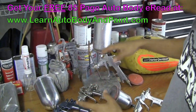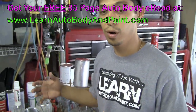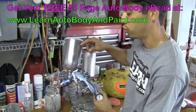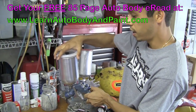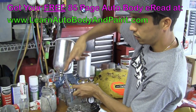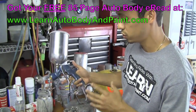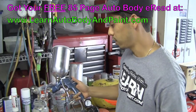As we get into the newer technologies, something called high volume, low pressure evolved. High volume, low pressure guns are gravity fed, which means you put your materials in up top and gravity feeds it down into the neck and then you spray out. These are gravity feed guns — the most common ones and what I recommend you get started with on your projects.